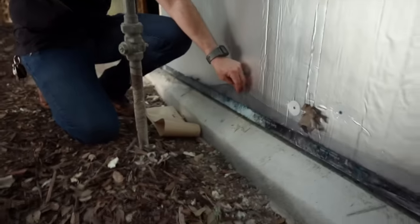Assembly number eight costs $4.05 per square foot — about 30% less than assembly seven. I'm using 2x4 walls, which worked for my original foundation. I like having standard Zip sheathing for water and air resistance, giving a really tight exterior envelope — that's how I'm getting to passive house numbers — plus that thick blanket of insulation outboard of the sheathing. It does make siding a bit more complex since you need to add battens, but if you use standard Zip R, the insulation is sandwiched. In my opinion it's slightly better to go standard Zip and then put insulation outboard of that.